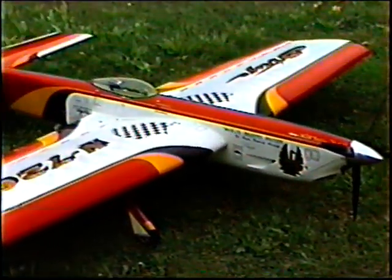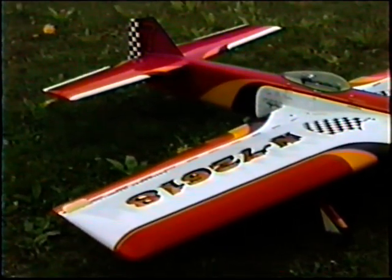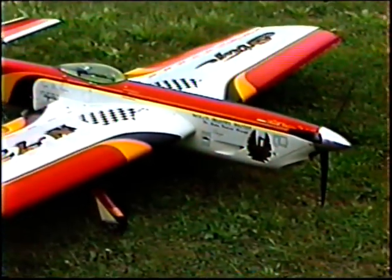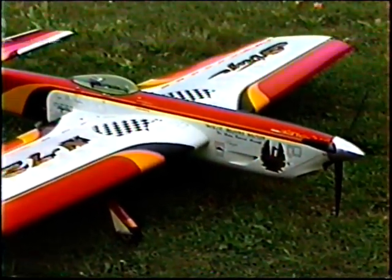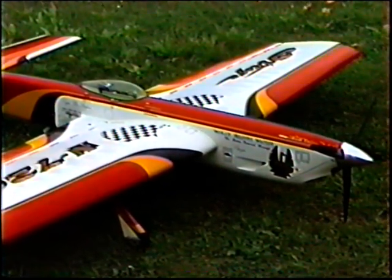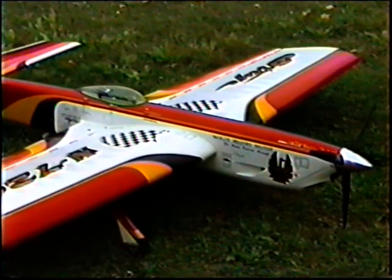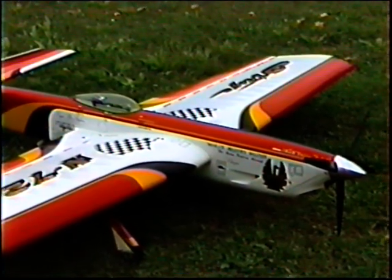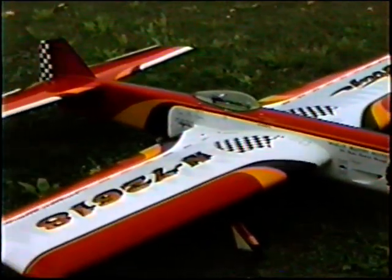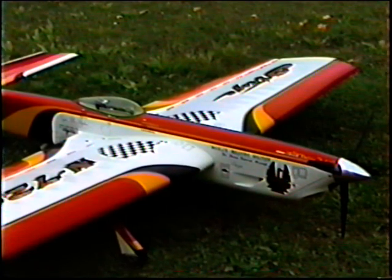I feel like one of the little pieces of information we definitely can put in the bank now, because we've got quite a bit of flying on this with the tank shim the way it is, if you're starting off with a Jet 60, probably going to be a good place to start is between 3/32 and 1/8 above the height of the mounts. And that's where we played with it for a while, and it came just about equal breaking both ways.